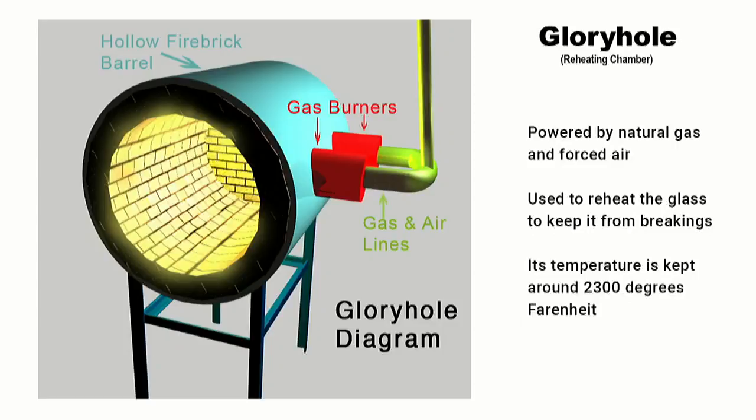Now, did you notice that there's a weird sound in here, right, when you came in? There's like a weird buzzing sound or whirling sound. Sounds like you're next to like a beehive or something. So that sound is natural gas, our blower that we're using. Since our fuel source is such a low burning fuel, we need a lot of oxygen, a lot of oxygen. So that sound that you're hearing is the blower that's rushing in all that necessary oxygen to get the appropriate heat. If you guys go to any hot shop powered by natural gas, you're going to find a very similar white noise.